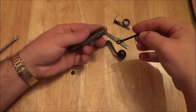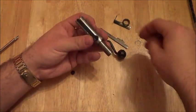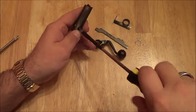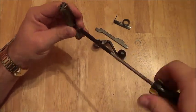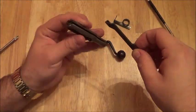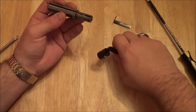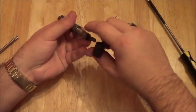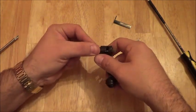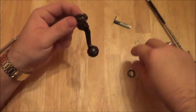You may be wondering if you can get these parts confused — you can't. You can't put the piece in the wrong side; it can only go one way. So let's get the bolt back together. When putting the firing pin back, make sure — hold it upside down and just drop it in like that. Take the bolt. You've got to remember there's a little tab right here on the firing pin. You've got to hold the bolt out just a little bit, the firing pin out. Get the tab to go inside — right there — that little tab.